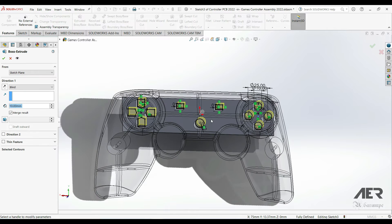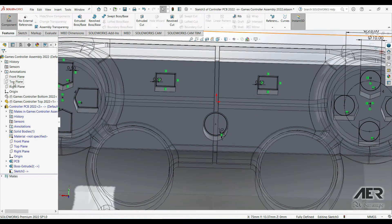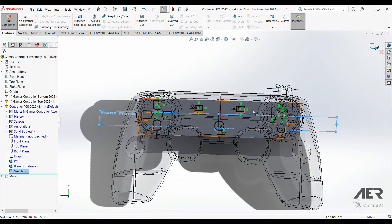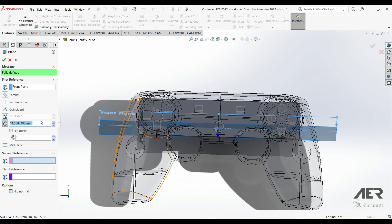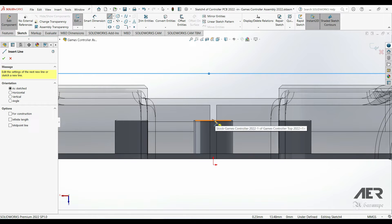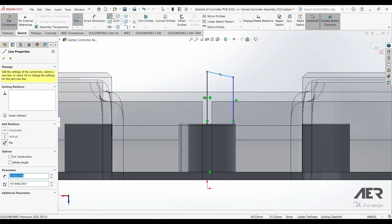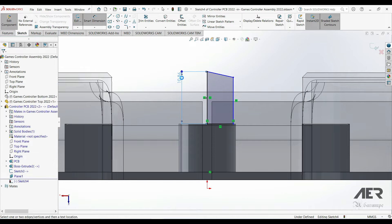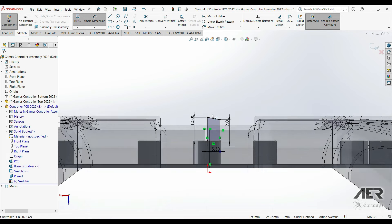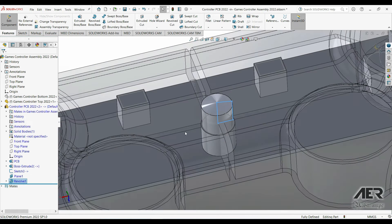Now we should have four pentagons, five circles, a rectangle, and a triangle in total. We can extrude these upwards to make the tops of the buttons. I'm going to extrude in three different sets because the buttons are at slightly different heights. For the PS button we choose the Front Plane and drag it to the middle of the circle, setting 11mm — half the distance. For the side buttons we'll make a profile with different heights, connecting them with a line set at 10mm and 9mm, then use the Revolve feature choosing the middle line as the axis of revolution to get a more convex shape.